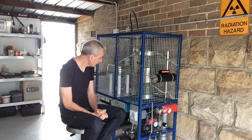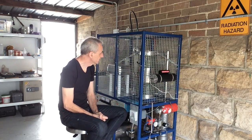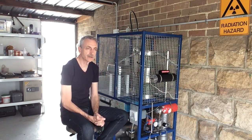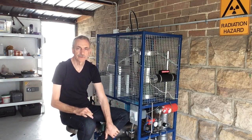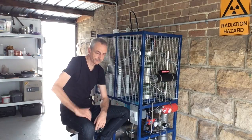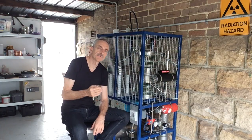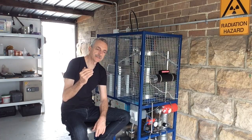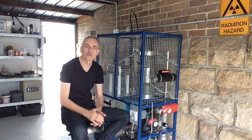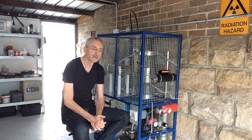So that's working, but the only thing we're not doing at the moment is making a lot of neutrons. You can speculate on what the reasons are. The main reason I can see is that I can't hold a stable plasma in the chamber. It either doesn't conduct at all — the voltage stays right up at 55 kilovolts — or as soon as the plasma ignites it falls right down to 5 kilovolts. There seems to be no sweet spot in the middle where I can hold the plasma burning. If somebody has any suggestions or ways I can improve that, I'd love to hear it.